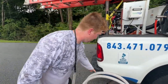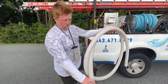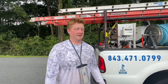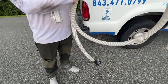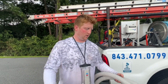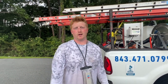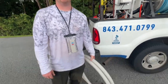The second thing is this sludge sucker — kind of a crazy-looking piece of equipment. The pressure washer hose attaches to this little nozzle right here. It's called the Venturi effect — I'm not even going to try to explain it — but basically it turns your pressure washer into a vacuum. When you pull the trigger, it sucks all the water and air through this tube, and you can direct it somewhere in the yard. If you have a low spot on a driveway, you can throw this out in the lawn or landscaping and get rid of all that dirty water, so you don't have a mess and it'll save you tons of time waiting for it to dry. So if there's poor drainage, this is the tool that you need.